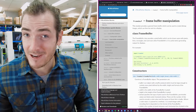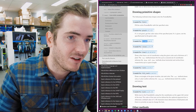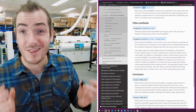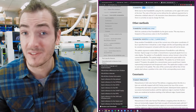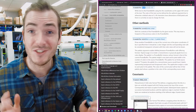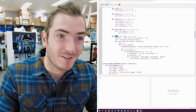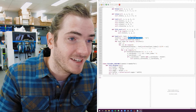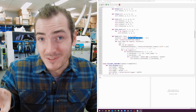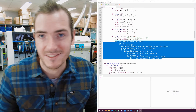For the Raspberry Pi Pico we use MicroPython's built-in FrameBuff class. FrameBuff is built into MicroPython and it handles a lot of things like text, lines, and shapes — you can set pixels, horizontal lines, rectangles. That's great because it means this very capable class is already compiled into MicroPython so it works very fast. For Raspberry Pi and MicroBit's flavor of MicroPython they don't have a FrameBuff class, so we have a redefinition of that text function that works in exactly the same way — it's just that we've written it. We load a font that has to be provided, extract the pixel data out of that font, and map it into a frame buffer we construct that is the size of the display.